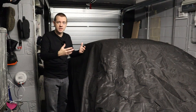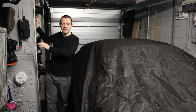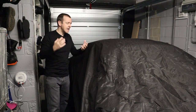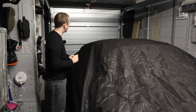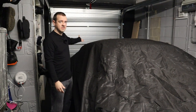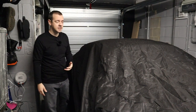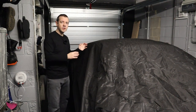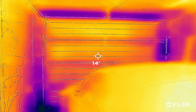That has made a massive difference. We'd have done it anyway for security reasons because this is far more secure — it's sealed around the edges and it's about as thermally efficient as you reasonably get from a garage door. It used to be that you could walk down the steps in winter and feel the drop in temperature immediately, even though there's a door between the garages and the rest of the house. Now, although you still lose some heat through these — they're not as good as a wall — it's made a big enough difference. When you walk down here you don't really feel a sudden drop, just a minor one. I'm quite convinced that over the lifespan of a garage door — 20 or 25 years — they will save more in terms of heat, especially given the cost of energy now, than they cost to install. The thermal camera shows this before and now what it looks like afterwards — still a heat loss, but much, much better.